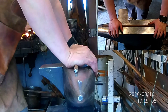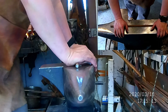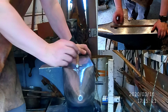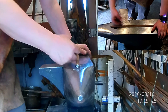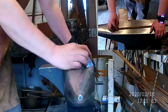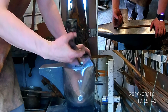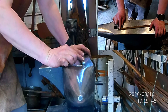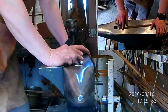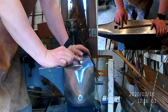Welcome to JLP Services Inc channel, my name is Jennifer. Today we're going to discuss why we leave a gap on the blacksmith's diamond when making a welded ring. Forge welding is a pressure weld, and we can make a welded ring using almost the same technique as the blacksmith's diamond. The gap is there so the ends don't butt together before the piece actually welds to the shaft — you want it to weld the shaft first, so you get a good solid weld. We're going to show how to make a butt welded ring using a mandrel.